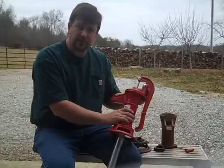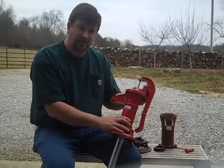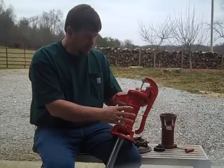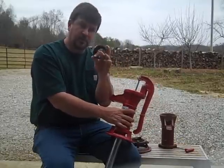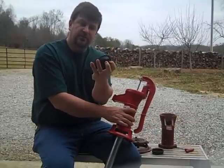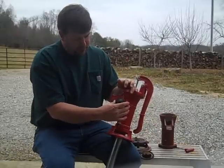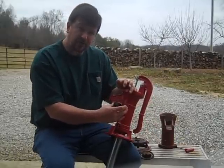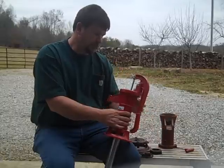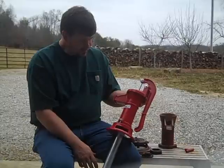You can pick these up at Lowe's or Home Depot, brand new with new gaskets for $50 — that's not a bad deal for what they can do. They can pump quite a bit of water. Inside the pump are two gaskets: a leather cup gasket, and a check valve gasket that goes in the bottom. The cup travels up and down in the cylinder making the suction, and then the leather check valve with a weight on it keeps you from losing your prime.